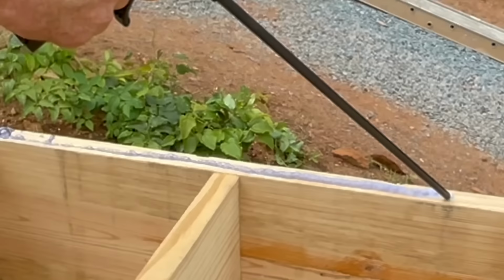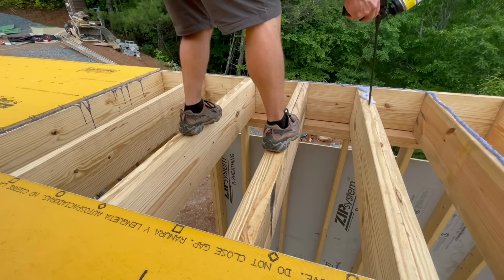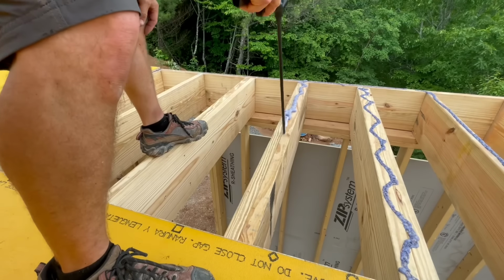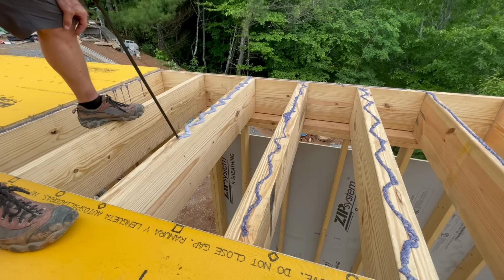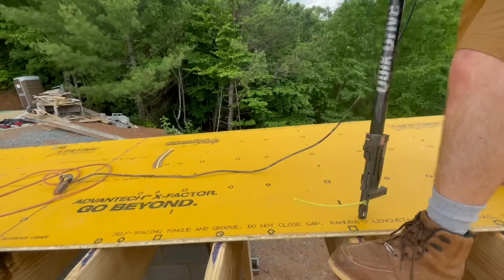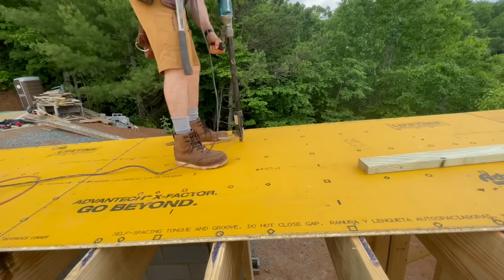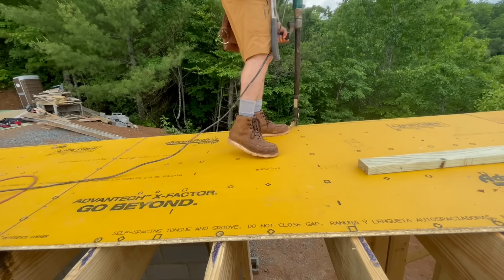It's sandwiched between the finished floor and the ceiling in the basement. And actually, a fun fact is that the squeaking you usually hear on a subfloor is actually the nail squeaking in the joist, not the wood actually squeaking. For that reason, we don't even use nails, we use screws. And we've been using this quick drive gun for a while. It's basically an extended version of a drill so that you don't have to bend down, and it can load these clips of collated screws to make it faster.